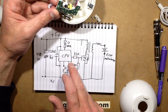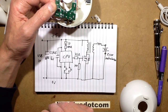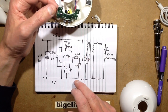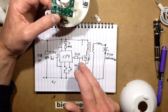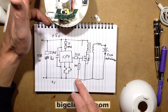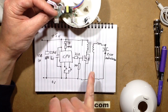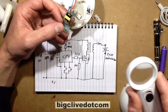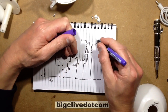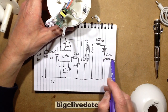The two buttons are internally pull-up-high pins — everything about this says PIC12, but it might be a clone or another variant with exactly the same pinout. When you press the buttons they pull the pins down. One turns on the LED and the other turns on the output, which appears to be a MOSFET because I'm getting the reverse diode across it. It's got a 33 ohm resistor feeding that and a 10k pull-down resistor. That MOSFET drives the primary of a small transformer, and the secondary references ground with a 470 microhenry choke in it, which then leads to the piezoelectric transducer.